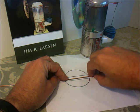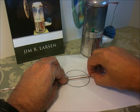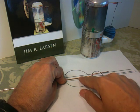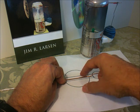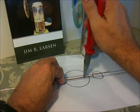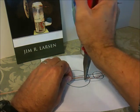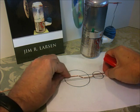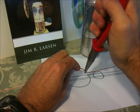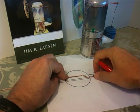It's very important that before you make the next bend, this piece is now standing up vertically, because there has to be a 90 degree phase difference between this bend and the next one. The next bend is going to go over to the wider line on that side. You can just change the angle of those bends a little bit, as long as you don't go up to 90 degrees, which makes it possible to change those distances.